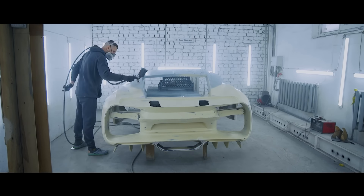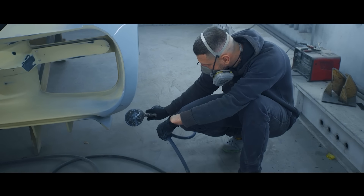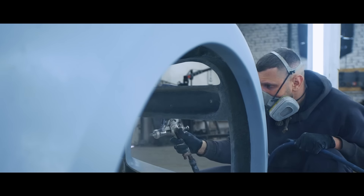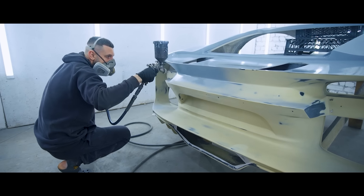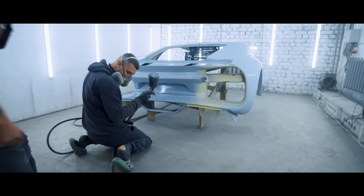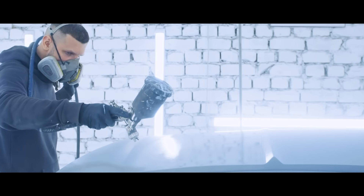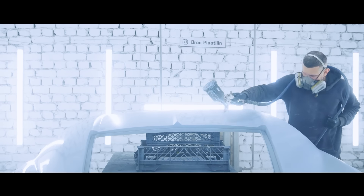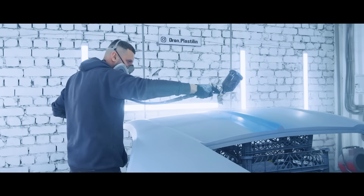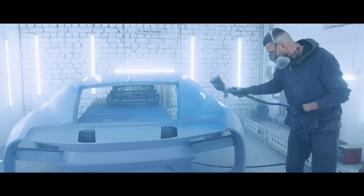As you can remember, we recently applied liquid yellow and brown putty. A few hundred days of polishing were off-screen. In the end, the body is perfect. The next stage is to apply the primer. This time we apply two layers: the first layer is a standard gray primer. We color the second layer a little to show you at least something that resembles the final car — more or less. Of course it's not the final paint job, but at least it's not gray and boring anymore.